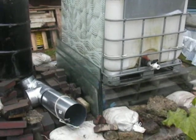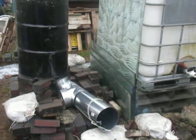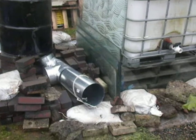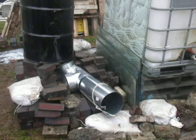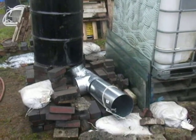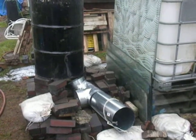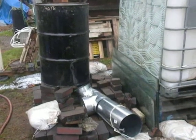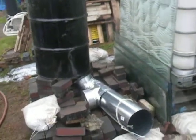Yesterday I started to manipulate some of the plumbing that will attach to this jet heater and I discovered that I was removing a lot of material that I had previously laid to get the pattern of a brick platform, which I will then probably dismantle almost entirely and reassemble with mortar, doing a little grade work as I go along. The struggle last night was that I was increasing the elevation by three bricks from the platform that had been constructed to manage the pipe up underneath the drum.